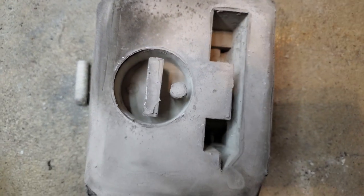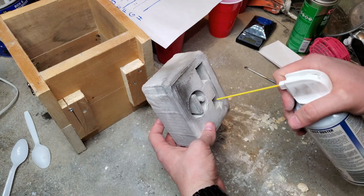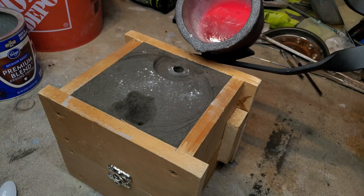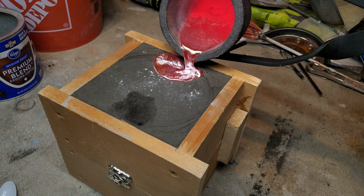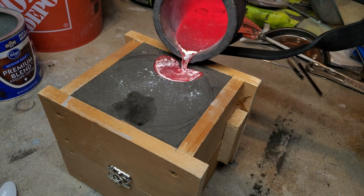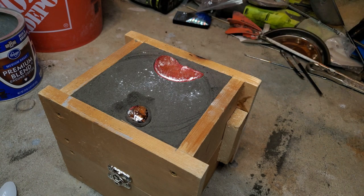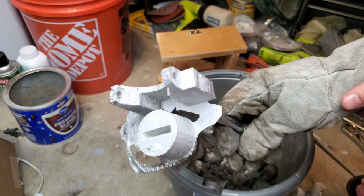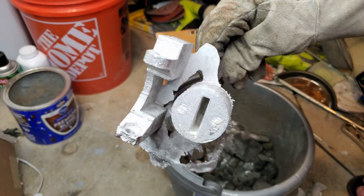One piece of the surviving block fell, but I can drill out that hole later. I remove the ash and other debris from inside the pattern, and then I prepare the cope and drag. I melt some aluminum and pour into the pouring basin. Let's check what we have now. It looks pretty good — the details are very impressive. Those layer lines are so clear and the corners are sharp.